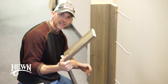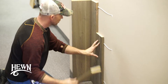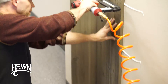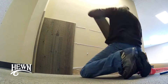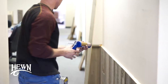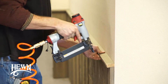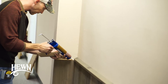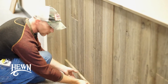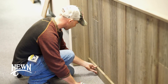I'm gapping a little off the floor because we'll put in a quick baseboard at the end, and we're just watching this line right here, making sure that we continue maintaining that line. I'll put a little bit of adhesive on the top as well. The baseboard is just ripped down to three and a half inches in this particular case and cut to length — real simple, straightforward. I'm not going to glue this because we're nailing into wood now; the nails will be strong enough. It should be adequate.